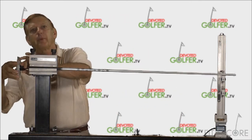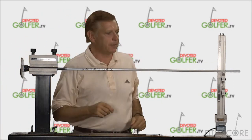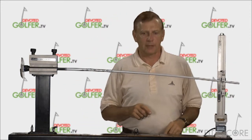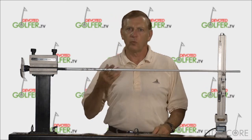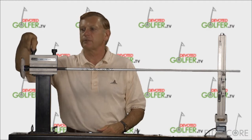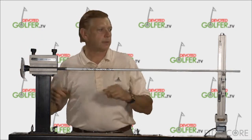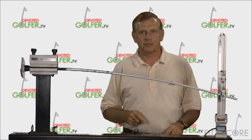We are going to use this to assess the spine or the radial stiffness of the shaft in 10-degree increments by using a protractor. I'm going to attach that protractor to the back of the shaft, tighten the shaft in the clamp, and I'm going to deflect the shaft one inch and take a note of that force. Now I'm going to deflect the shaft five inches and take another note of the force. The purpose in doing this is to gather the actual material stiffness of the shaft. By subtracting the one-inch reading from the five-inch reading, we remove the effect of the bow in the shaft. Now I'm going to turn it 10 degrees, re-tighten my clamps, deflect one inch again, take a note of the reading, and deflect five inches and take another note of the reading.